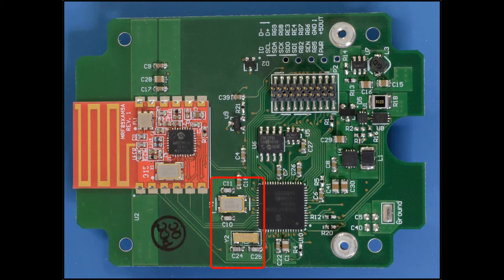There are two low power crystals: 8 megahertz and 32 kilohertz. Using the PLL, the 8 megahertz clock source is multiplied by 4, providing a 32 megahertz system clock. The 32 kilohertz crystal runs the real-time clock calendar function.